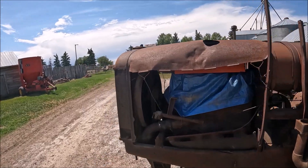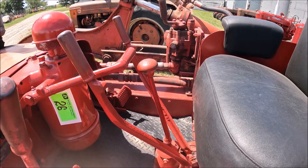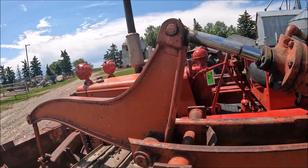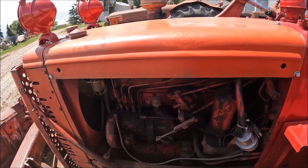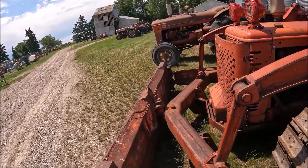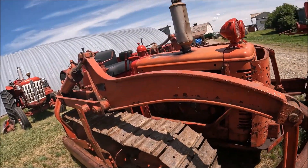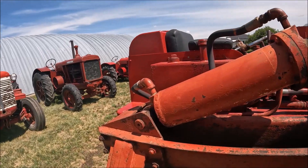Here's a TD9. It's got the steel gearshift knob, so it'll be between 1943 and 1945. Good undercarriage on it — the undercarriage is really good. It's got the Bucyrus dozer on it. This one's got a Bosch pump — Bosch injection system; most had IH by then. The lights are there, everything's all there. It's a nice little crawler — nice and straight, not beat up. The original grill is behind the grill guard and it's perfect. I don't think the crawlers had screens in the grills. This is a really good TD9.